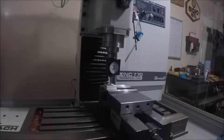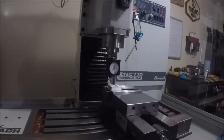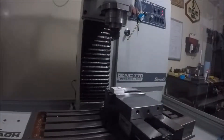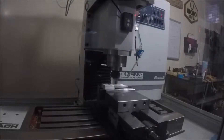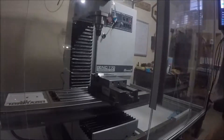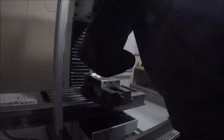I have to make two of these same parts. I have the Haimer in there and I put the workpiece way at the end of the vise so I could get somewhat repeatable results with both pieces. Here is where I realized that my zero points were way off. With the Haimer, I decided to put them where I thought they were relative to where they should be, and yeah, it was all a big mess. I had to put the Haimer back in and check everything out.